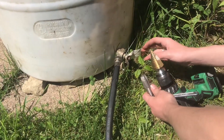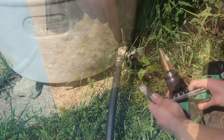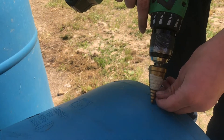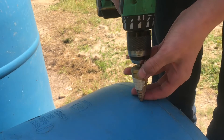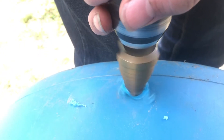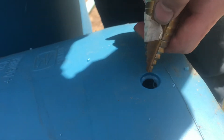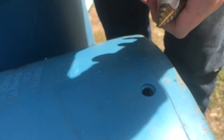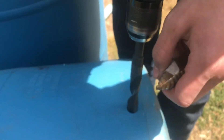We're going to make another rain barrel just like this one, which seals great and works perfect. We'll go ahead and drill our hole — we have it marked out with tape. Make sure we don't drill it too large. It's a little too thick for our step drill, which is a good sign that means this barrel is thick — almost twice as thick as our old barrel — so we need a drill bit to go through the rest of the way, and this is an 11/16.